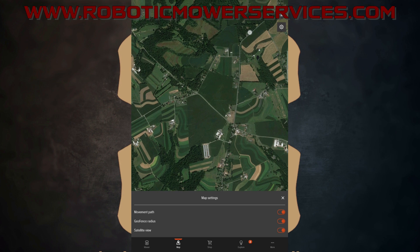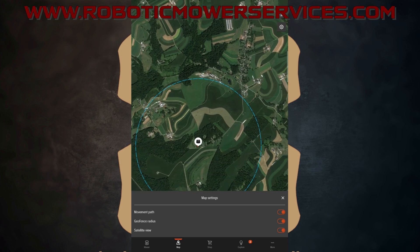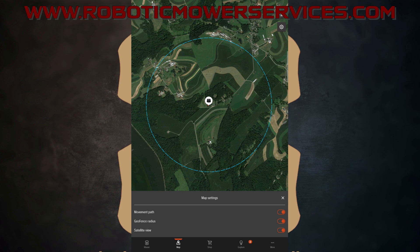As soon as they turn it on it's going to set off all kinds of alarms, and they'll need the pin code to shut it down. It's going to keep going off until they turn off the geofence or set a new center point. If you're doing repairs on automowers, I'd suggest not changing the center point — just turn it off, so when the customer gets it back home they can turn it on and it'll have the same center point. If it does get changed or you move to a new house, just take the mower out in the backyard and set a new center point.